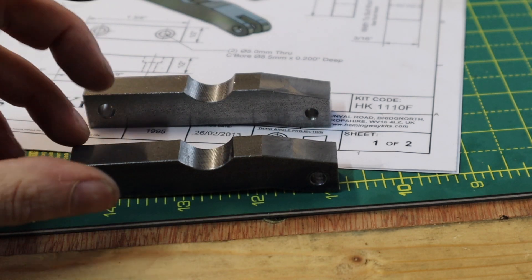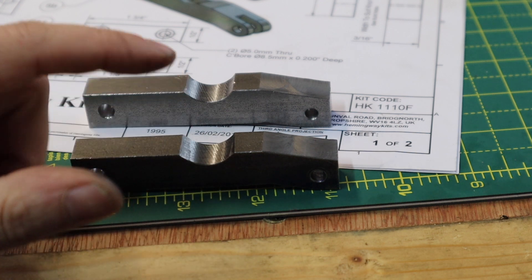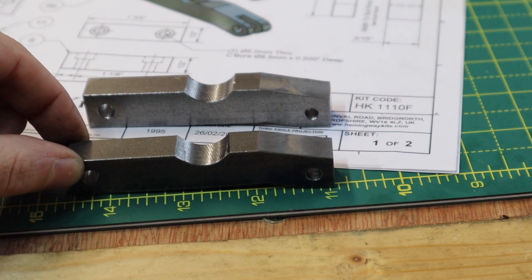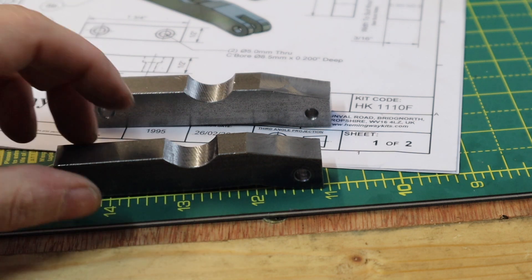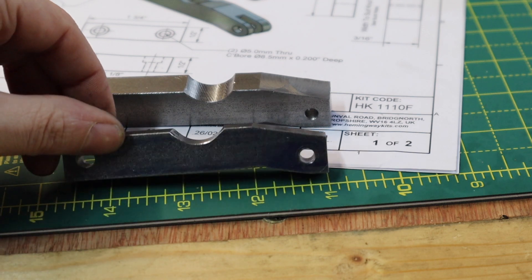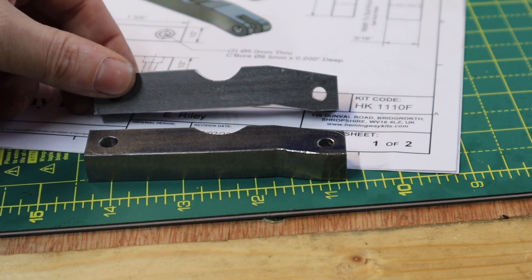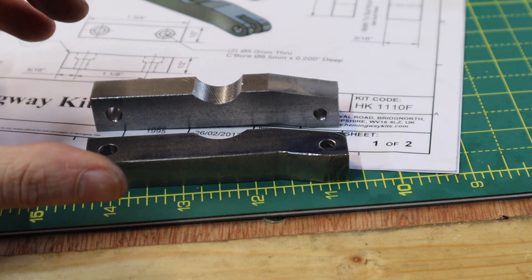Surprisingly, given the dodginess of that last operation, these parts have turned out pretty well. The whole plunging in with a 20mm end mill didn't go as planned - I immediately regretted it after starting but I was too far in. I'm quite happy with the surface finish though. The only downside is this recess is now slightly larger than the drawing states, but I can accommodate for that with the little half-moon shaped parts that are going to sit in here. Next I need to add the radii onto the ends of the part - I've split the parts up so that if it goes wrong it only affects one arm rather than having to scrap two.